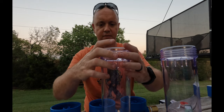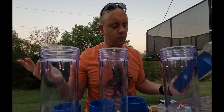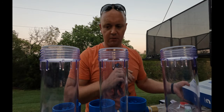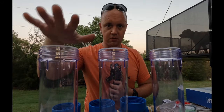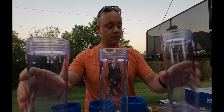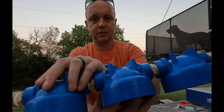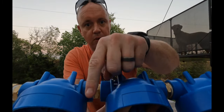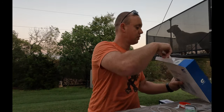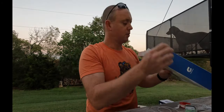You can choose any water filters you want as long as they step down in micron size — most coarse to most fine. We want to go coarse, medium, fine. One thing I really like about these housings is that there are places for labels, so we can label them with a pocket label maker. We went with the ClearSource Ultra system because they fit universally, which is nice.